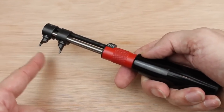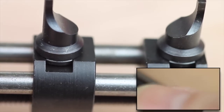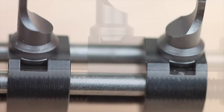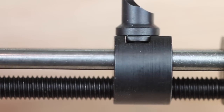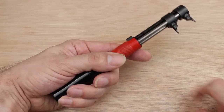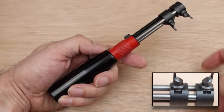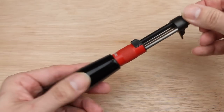You can adjust the distance between the pegs to accommodate different diameters of watches. Use the thumb screw at the back to rotate left or right to adjust in or out. The jaws are adjustable from 18 to 65 millimetres, so you can accommodate most watch diameters. A friend who collects high-end watches commented on the very fine pitch of the screw thread, which allows for very smooth adjustment. He also noted the jaws are very sturdy with no play or wobble at the tips, and how comfortable it was to use.